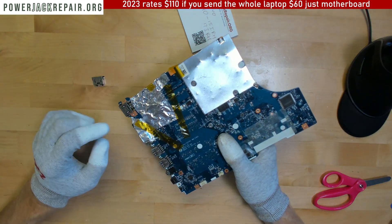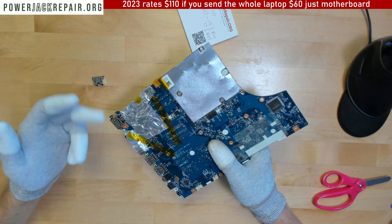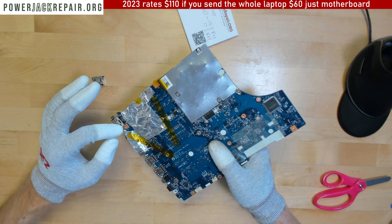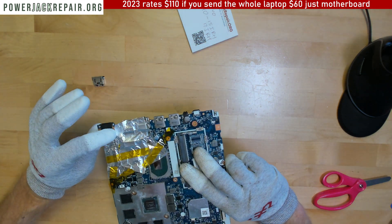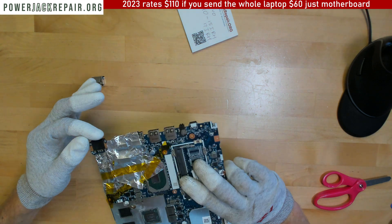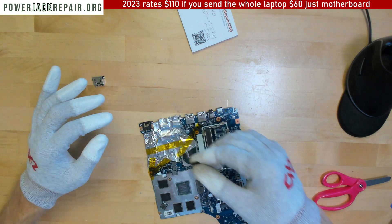That's how you insulate - make sure that this component is covered by the insulation. What we're gonna do next is use some leaded base solder for the connection points right there. The jack was definitely faulty because people wiggled it to death.